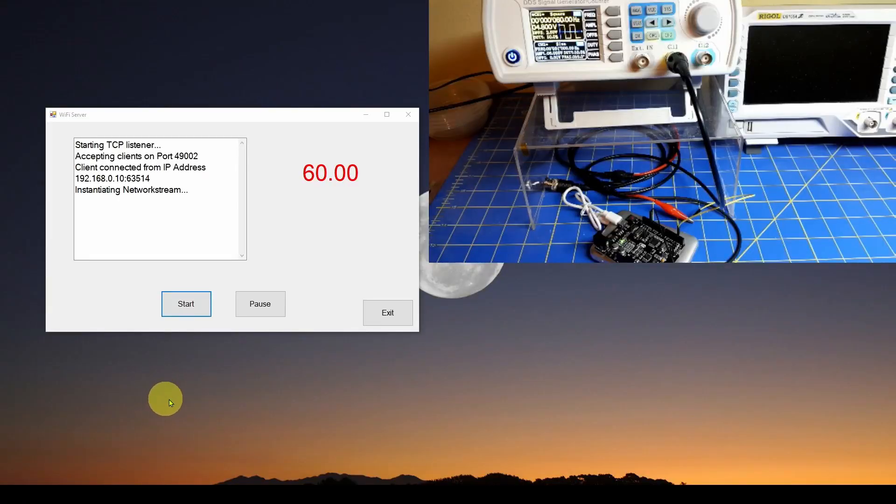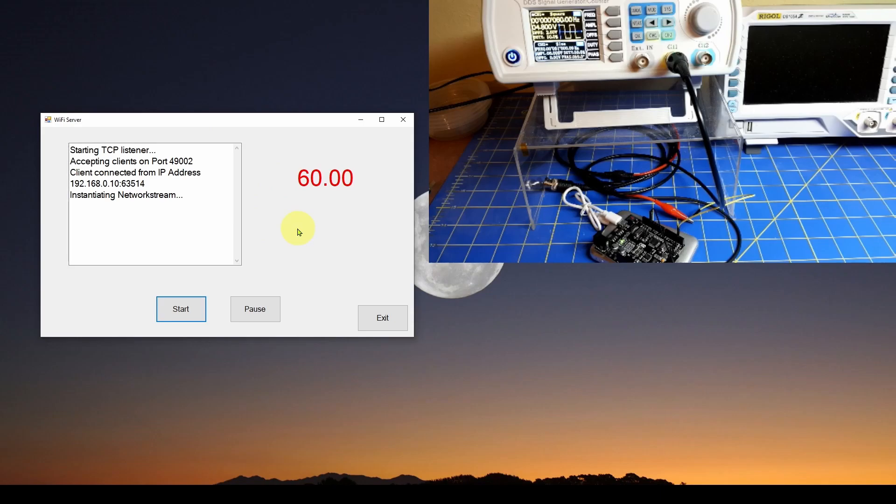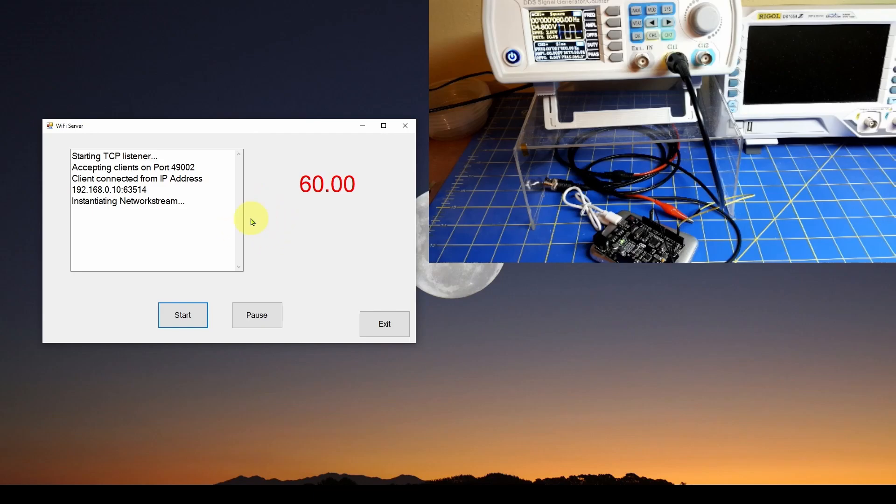All you have to do is take it remotely, plug it into a wall outlet, and it will measure the frequency and send it to your computer. The software we're developing in this video and the next will let you see an application listening to the Arduino over Wi-Fi, grabbing data from it. The Arduino is connected to a signal generator feeding a 60 Hz replica of a wall outlet signal, and it's measuring exactly 60.00. In this video, I'll show you how to write the two Arduino sketches — one for the ATmega328 and one for the ESP8266.